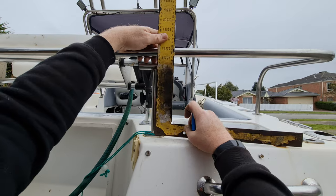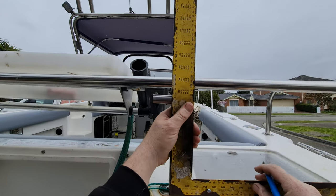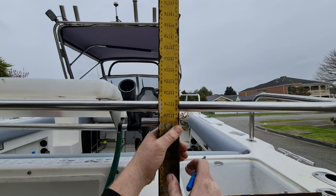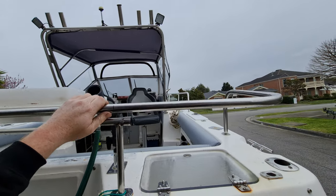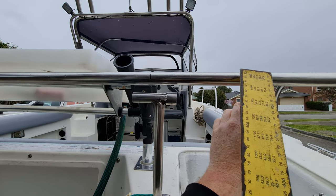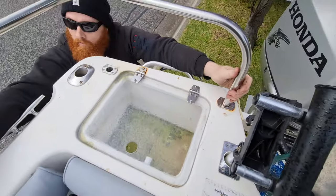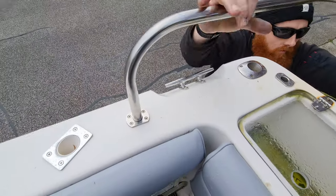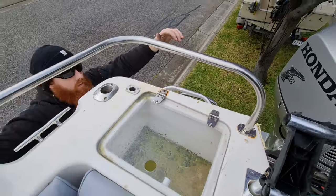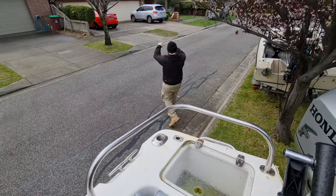It's probably not ideal to do this in the rain, but that's okay. I mark that, and then again — subtract the 150mm bend radius. I'll take this back from the outside, come back 150mm, and by the time I do my bend it'll come right down into there. In we go — oh yeah, that's good. Like a glove. Magnificent.